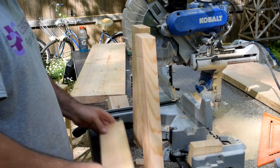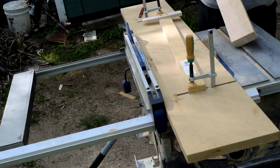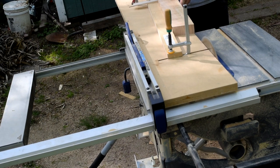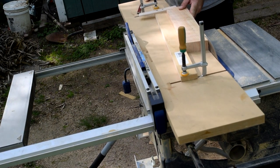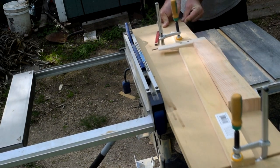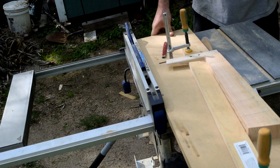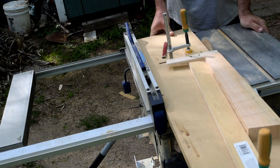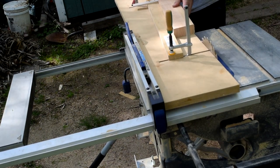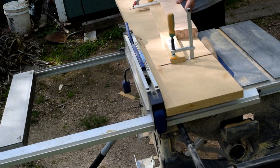Just like that — make sure to be flat. Here I got my little jig out to give these a tapered edge. Last video I was saying 'tamper' — nobody's called me out yet, so I appreciate that. I'm giving these a tapered edge: two inches at the bottom to nothing at the top, so three and a half inch. Let that blade stop — just like that. I'm not even clamping these down, just got that stop block on the back to hold it in place, slide it in and push it through.